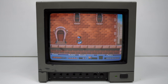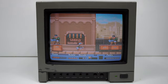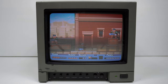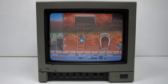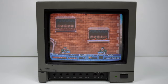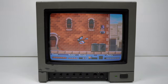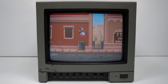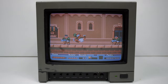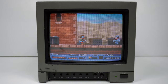As for the picture quality, I'd like to compare it to another monitor of similar size via S-Video to get a good idea, but I don't really think this monitor outputs anything special. I can't see much advantage of this unit over a regular television of similar size. The nice flat flush sides are handy if you want to rotate it vertically — that might be an advantage over a 10-inch TV. But all in all, no RGB, no component, does have S-Video. Nothing particularly special about the PACOM, so just go for a regular television instead.